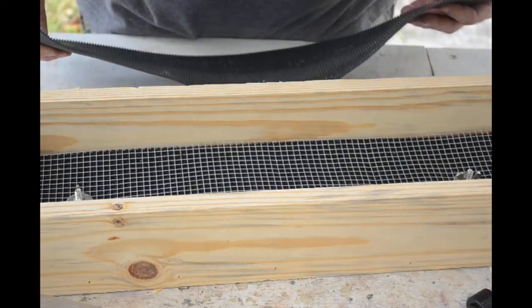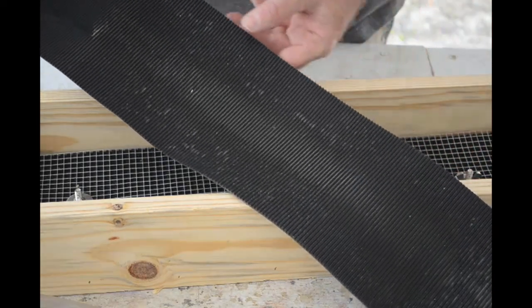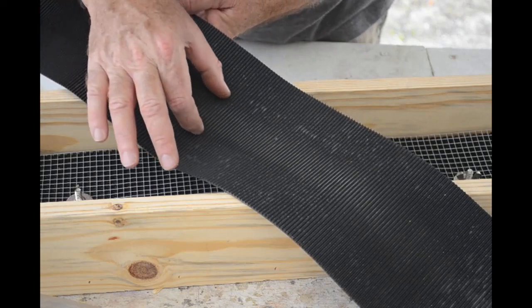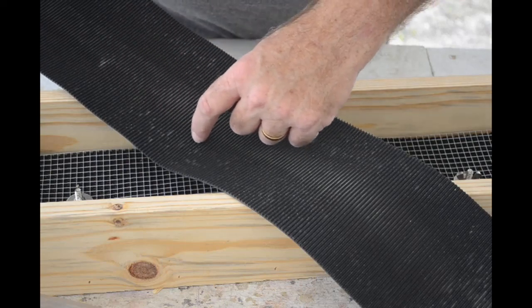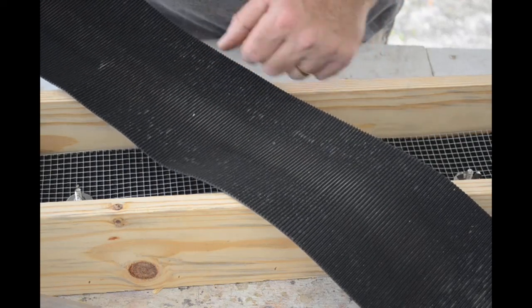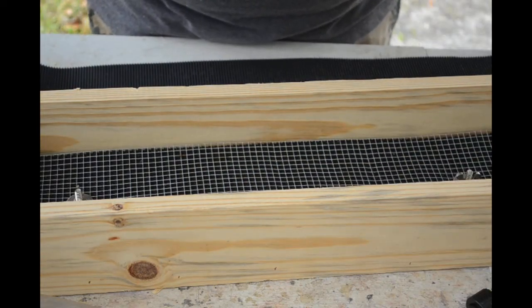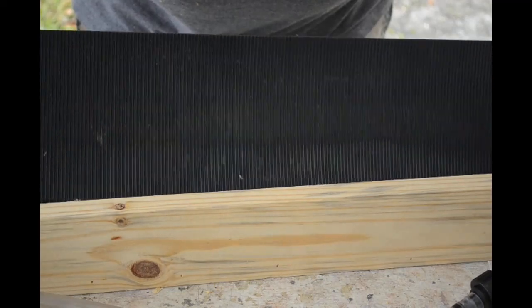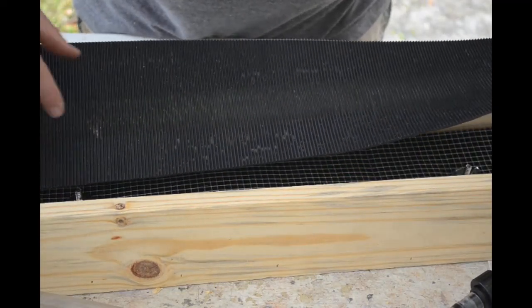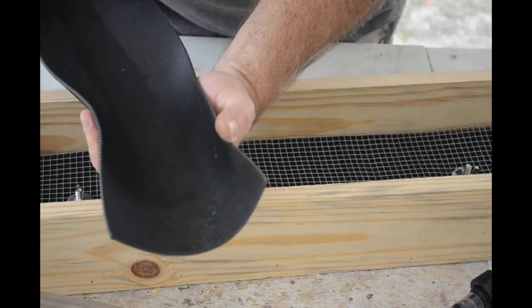Now you may not think that this sluice is a whole lot bigger than the cleanup sluice I used in my last video, but look at this. I hope this is showing up on the video. You see this line down the mat here? It's only about 1/4 to 1/3 of the width of the mat. That's the only part of the mat that was catching anything. So this is actually going to be at least three times the area for catching stuff as my little mini cleanup sluice did. So I think this is going to catch more because I'm using the whole mat rather than just a little skinny stripe down the middle of it, because the mat's held like this in the little mini cleanup sluice.